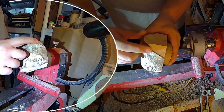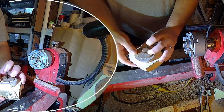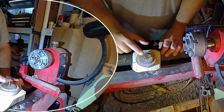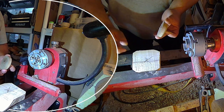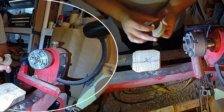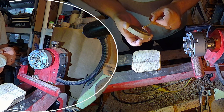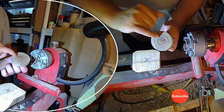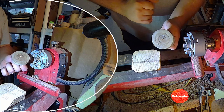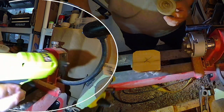So I'm going to see if I can't actually turn this into a nice little live edge. And start off with a glue block here, using my centerpiece, or as close to center as I need to there. Use my toothpick method here to make sure to try to line this up as best as I can. My glue block has some of these ridges down underneath here as well. Helps to create additional surface for adhesion to the piece itself.